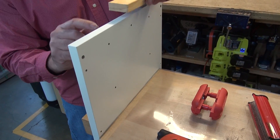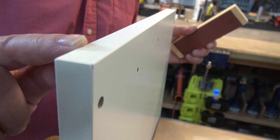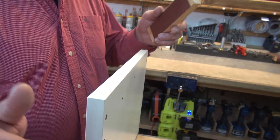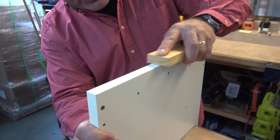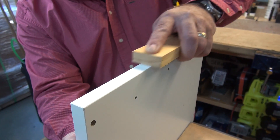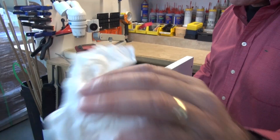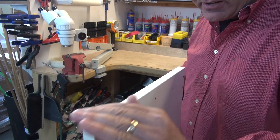The critical thing when you sand here is you cannot roll the edges. If you look at this edge, it's got a slight little roll to it already from the automatic edge bander — a little radius — and that's not a good thing because our edge banding can't roll over that edge. So I'm simply going to take my sand block and scratch the surface, making sure not to distort the edge by rolling. Everything flat, crisp and clean.